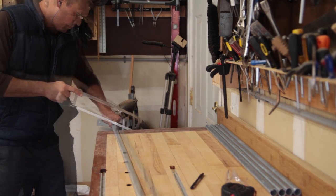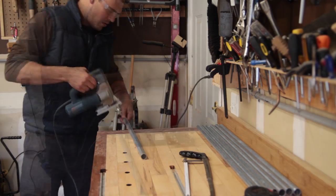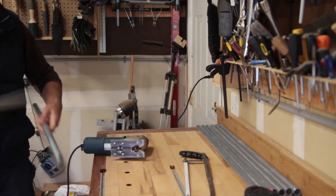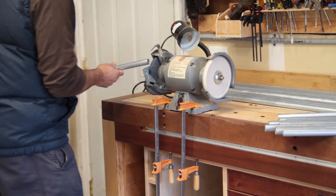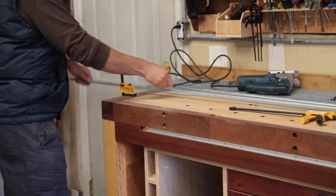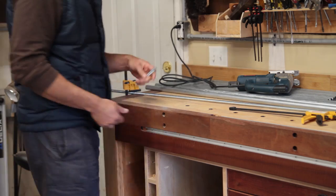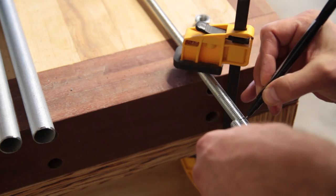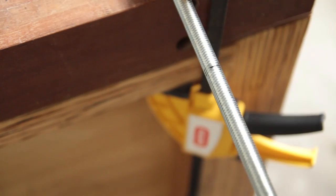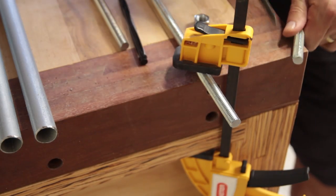I started by cutting down the metal rods — both the threaded rod and the tube. I used simple electrical conduit: it was cheap, easy to cut. You could cut it with a hacksaw, but the jigsaw works better. Getting those long tubes cut first worked well to get them out of the way. For the threaded rod, I used a 10-foot piece of super strut from the electrical department — cheap and it worked great. The jigsaw worked well for cutting it, though I found that bi-metal blades work quite well after overheating and ruining a few regular blades.